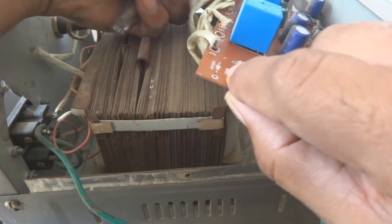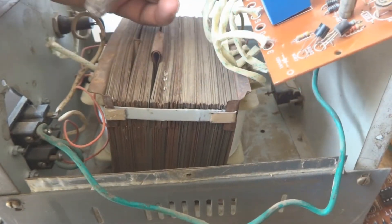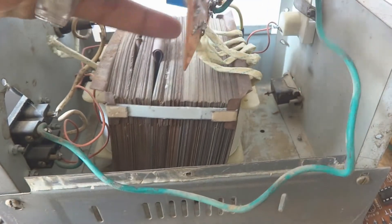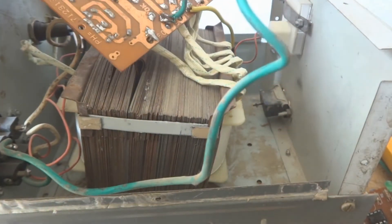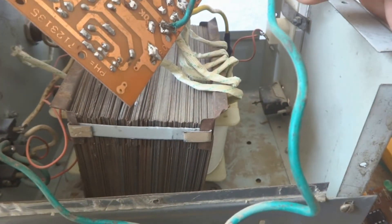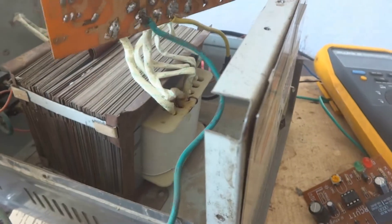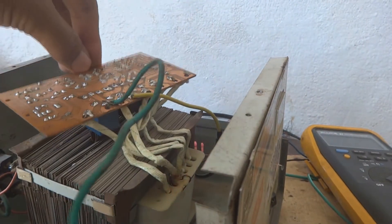The transformer is also wiggling — bad design. I'm going to remove it for testing and making the connections. First, we will check for the working voltage, which is 12 volts for our circuit — though 12 to 15 or 16 volts will also work. I will show you where we can get this voltage. A few wires from the transformer bring a small 12-volt control supply.